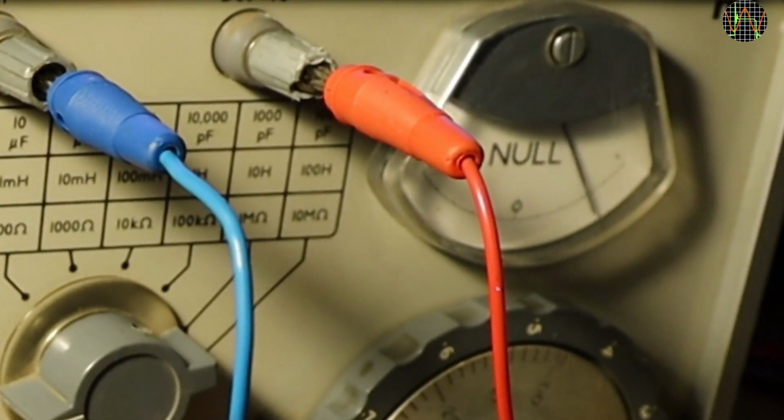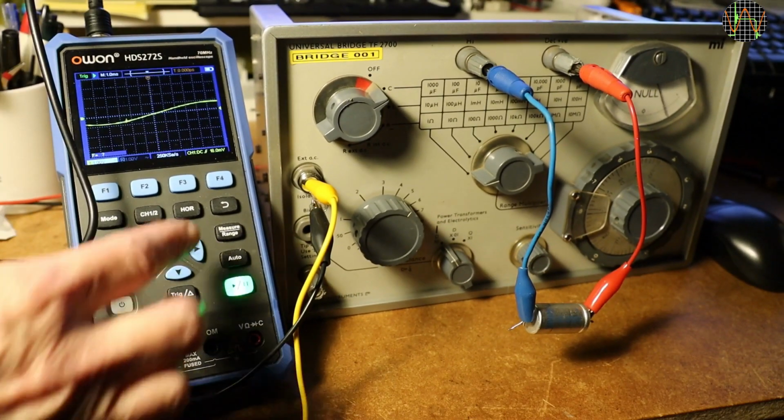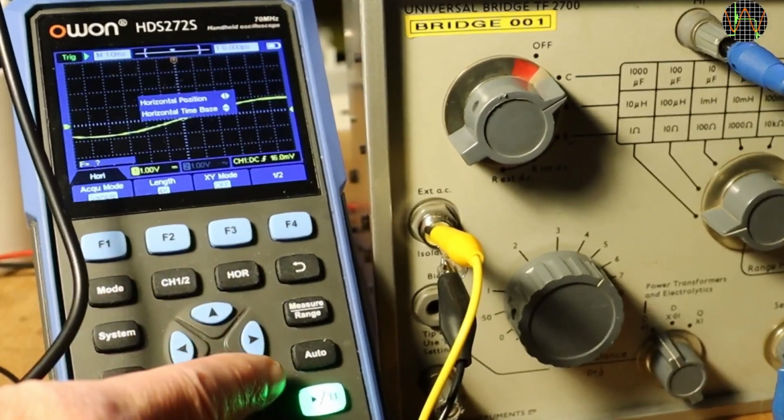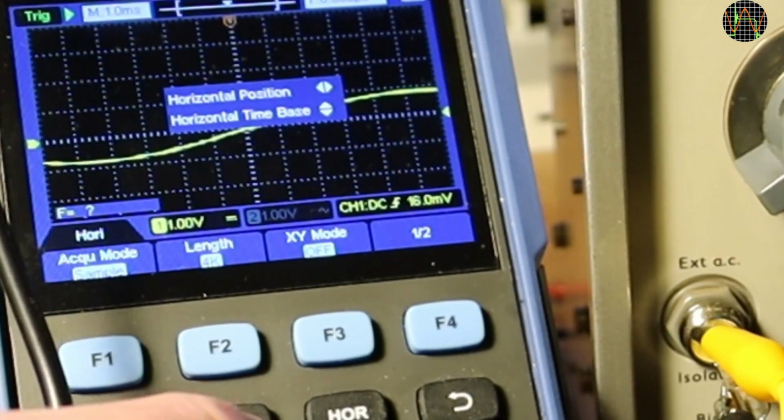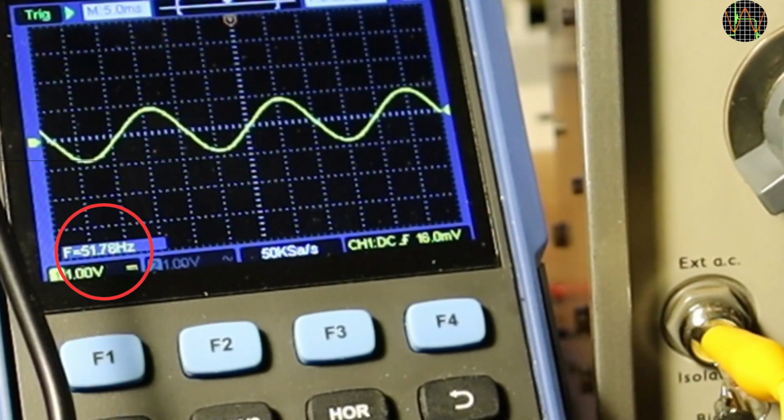The reason is that I'm feeding externally an AC that is just slightly higher in frequency than the mains hum of 50 Hz, and the meter amp signal varies with the beat frequency between the two. I can make it swing faster if I increase the external frequency. The point is, I need to make myself a totally shielded transformer and cable setup to avoid getting mains hum into the amplifier in the first place before I can use this feature.